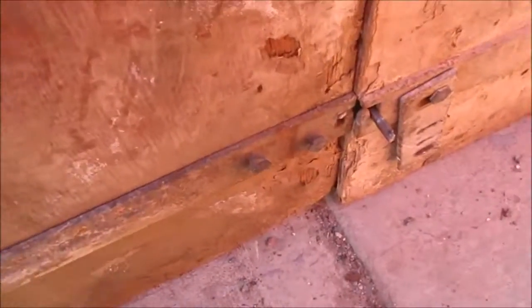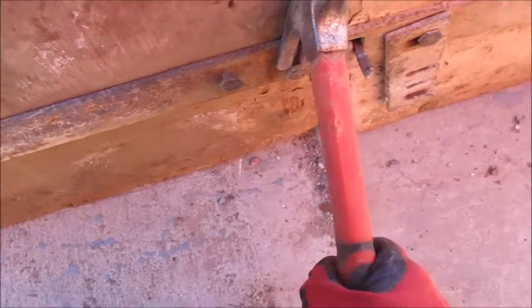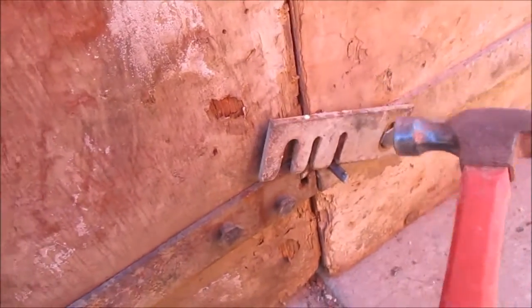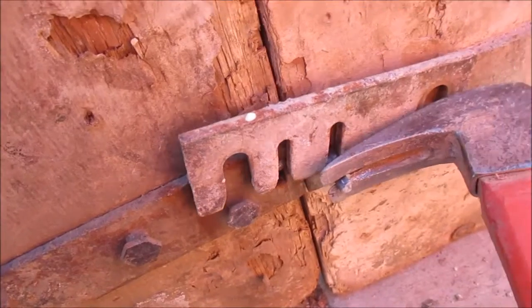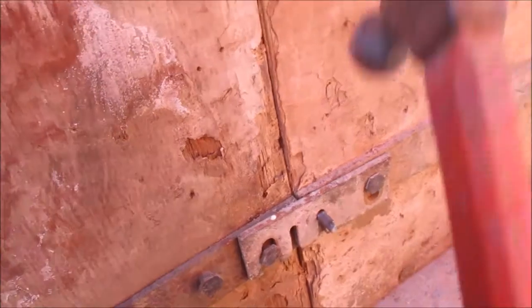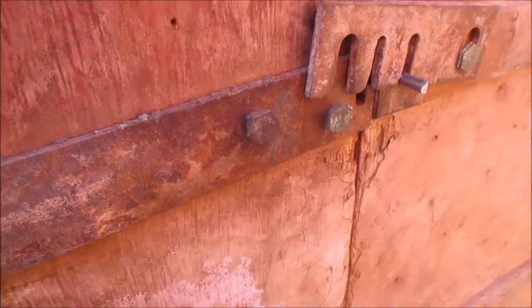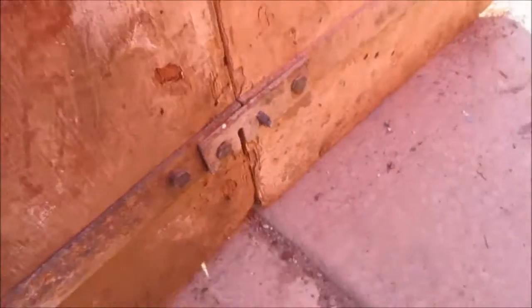Now, as you can see, sometimes the form might come misaligned. Grab it with your hammer and just pull it out a little bit, put a little bit in, flip this clip. Now, if you see your snap tie is not quite out all the way, a little trick is to do like that. That'll pull it out. Bang. You're in business. Then you come up to the middle, which now will be the easiest because the other top and bottom are in. And there you go. Now these forms are totally secure to one another.